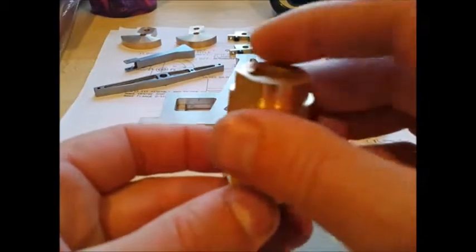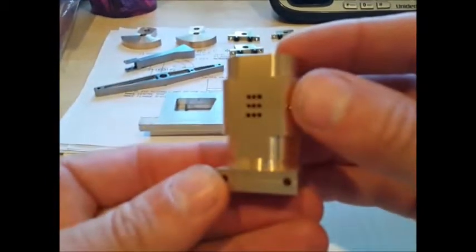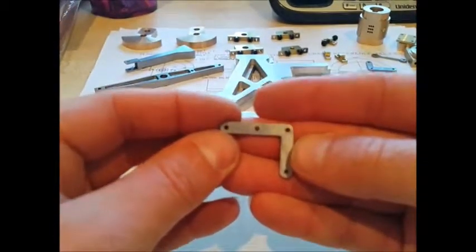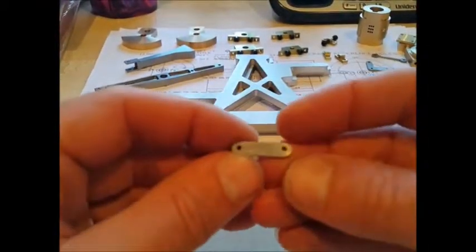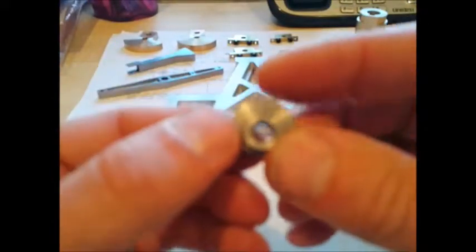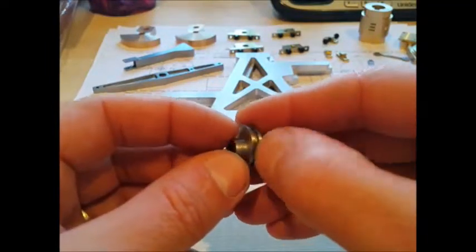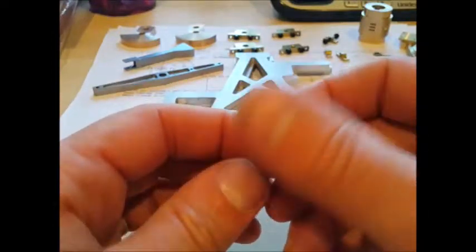This is the bottom half of the cylinder, so the cylinder will just sit on here like so, and then I've just got to make the cylinder head. Then these are the linkages I've made so far — they're just made out of normal steel, they just need a polish up. Then we've got the eccentric which does the timing for the slide valve. They might just need a bit of final messing around to get that to work in the eccentric strap, which is something else I haven't made yet.